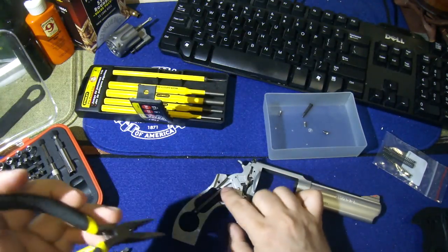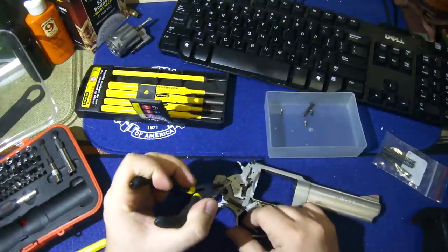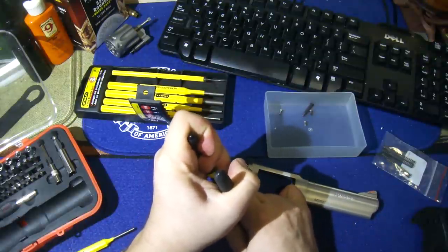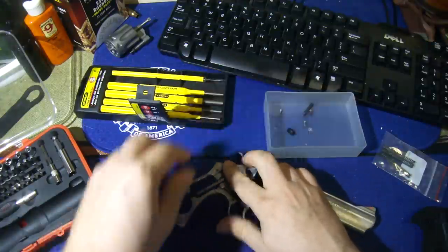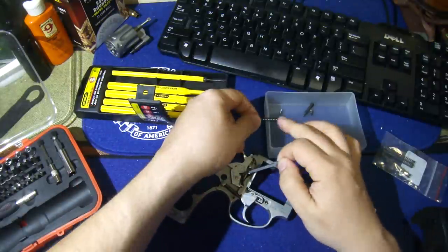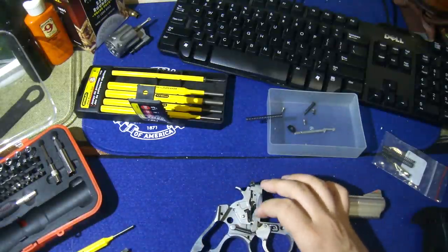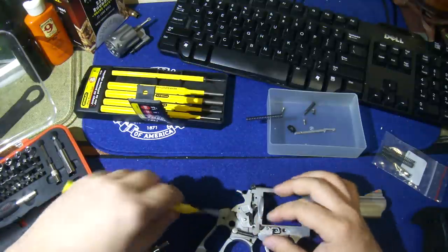Let's get out that mainspring — we'll use our needle nose pliers for that. I'm going to grab the mainspring bar and depress it back so I can get this little bar out of the way and free it from the hammer assembly. That came out easy, and there's this little tiny plate that it rests against — don't lose that, that's really important. Here's the hammer spring, or the mainspring. The little bar it pushes against — that's what we're going to change out. I'll also show you the trigger reset spring since you can change that.